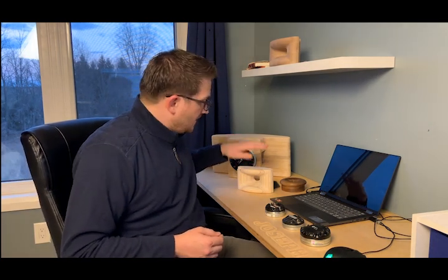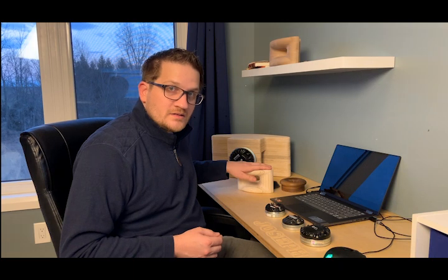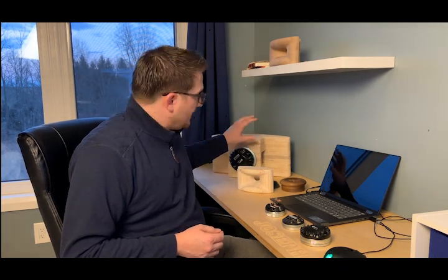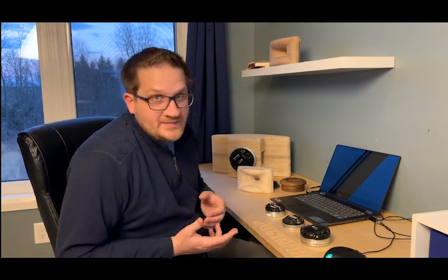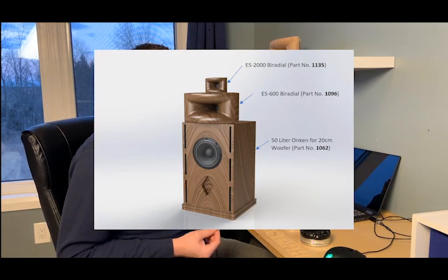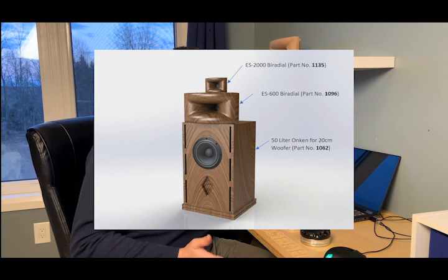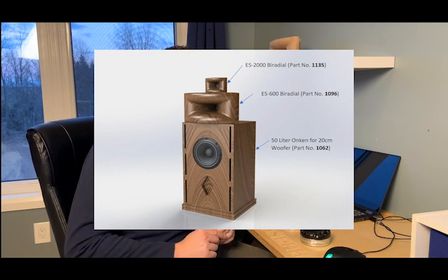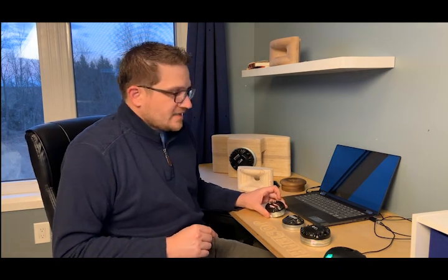This horn is a 600 Hz to 2 kHz horn. Using the two together, you would typically have a bass cabinet playing up to 600 Hz, then the mid-range horn, then the high-frequency horn, with crossover points around 600 Hz and around 5 kHz.